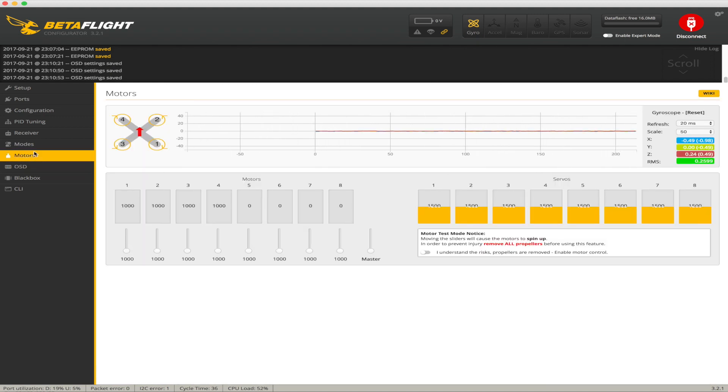Now let's check the motors. I still have my radio on. I'm gonna connect the power — use this battery. Let's go to Betaflight. I'm gonna turn on the motors. Motor one — spin direction is correct for motor one, at point 0.009. Motor two — we need to reverse the motor direction. Same for motor three. Motor four is correct.